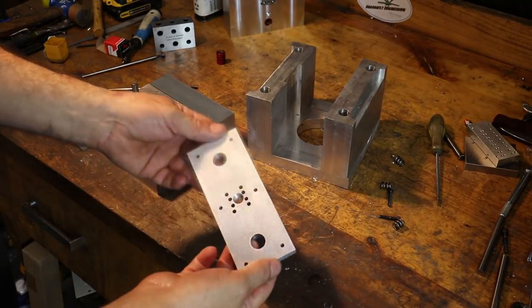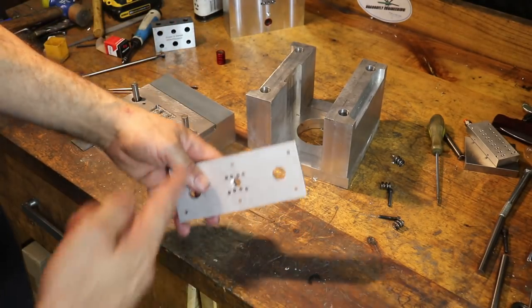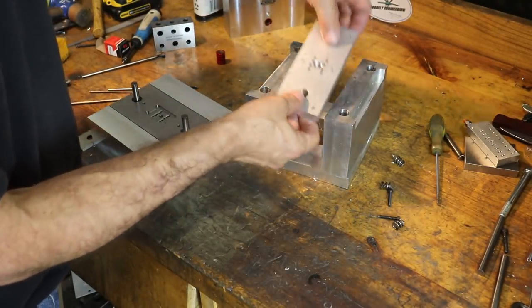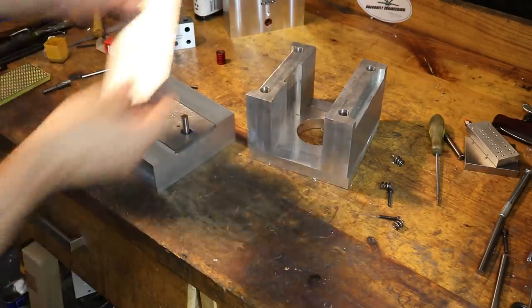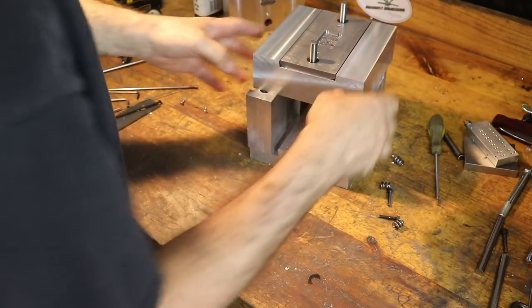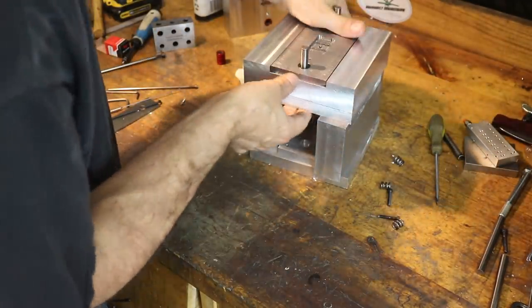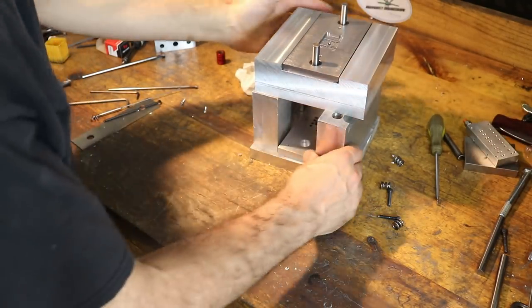All right, I'm back. So here is the base ejector plate, and this half 13 threaded hole is where the push rod for the molding machine engages and then pushes this whole plate forward up through the mold like this. So this plate's gonna push forward with all the pins attached to eject the parts off of the stripper plate over here. So to do that, we need to stack all this up and measure. So we'll put the mold block, the B-side base, on here, and I'm feeling for any kind of issues as long as you clean it off. Okay, so that's got a reasonably good thud to it.